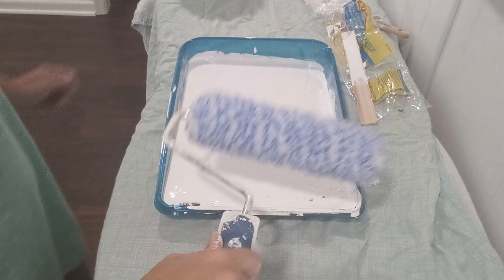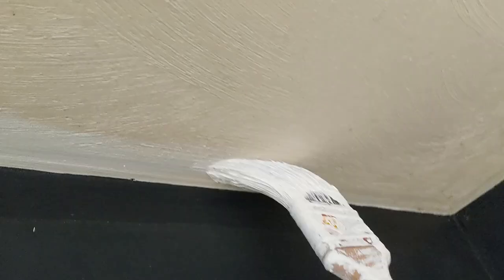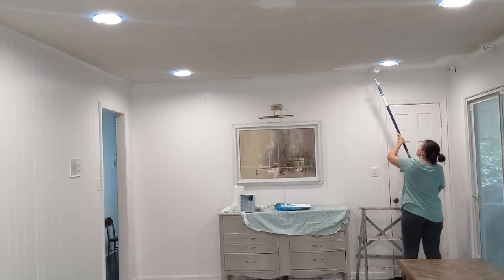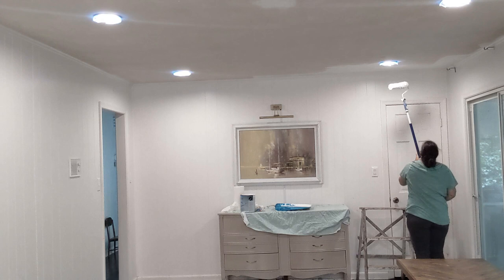You're also going to need a paint roller that is meant for textured surfaces. If you're painting a textured ceiling like I am, that just has a thicker nap, and it really helps get the paint into all the grooves without you having to put a lot of pressure on it. You're going to need a good angle brush for cutting in around the edges — I personally love using Purdy paint brushes — and you're going to need a roller extension as well. A roller extension is really just a long handle that you screw into the handle of your paint roller so that you can reach the ceiling without having to get up and down on the ladder five billion times. You will still need a ladder for cutting in around the edges of the ceiling, but this still saves tons of time.